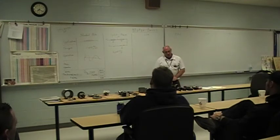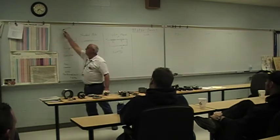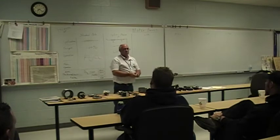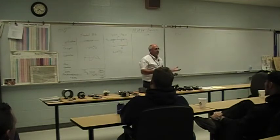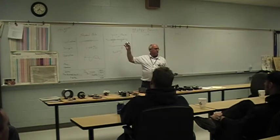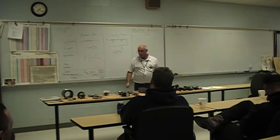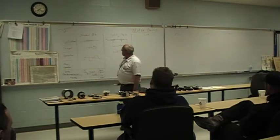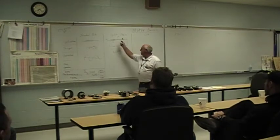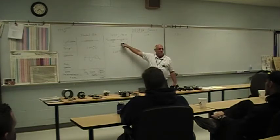I have a problem when I start talking about horsepower and motors because if we go back and look at what a true horsepower of the motor is, it would be 746 watts. You'll find out the smaller motors are going to use more than that to do the job. The efficiency is not going to be there in the smaller motors. I do know that if I'm figuring an electrical load, I look at a motor instead of horsepower and 746 watts - I'm going to put a thousand watts there. Basic operation of the split phase: it cranks up, gets the load going, and then the start winding drops out and it runs on the run winding.